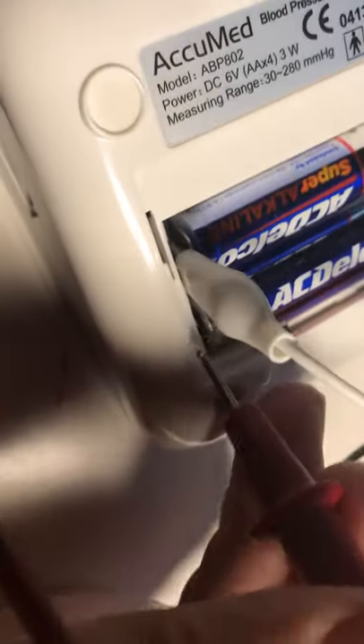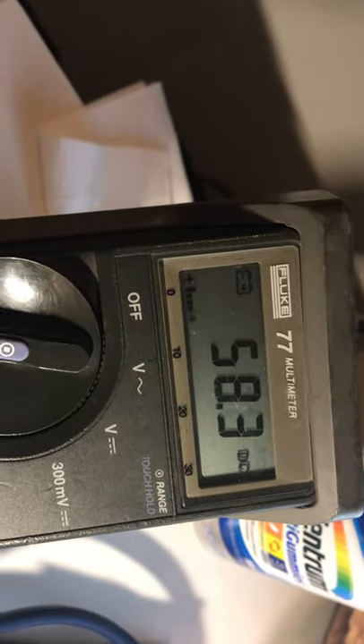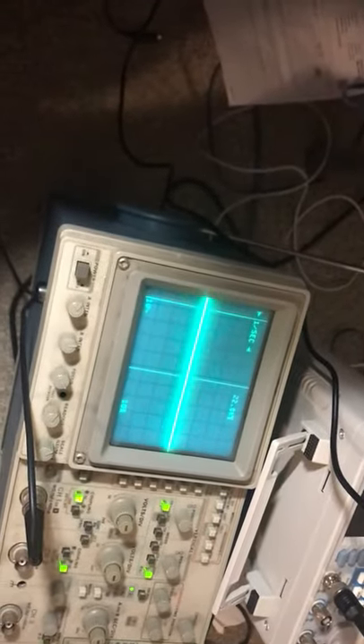I'm just going to power it up with the power lead — the red one for power, right here. I actually had that on a meter, so let's put it back in current mode. When I attach the meter to the power on the batteries, the board fires up — there it is. It's drawing 58 milliamperes at four volts and the board is working. There's the scope — power off, power on.